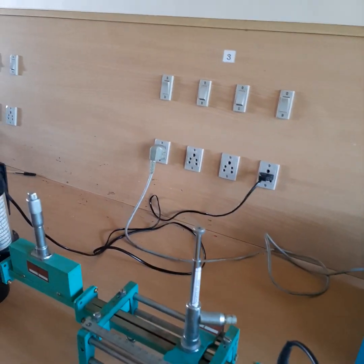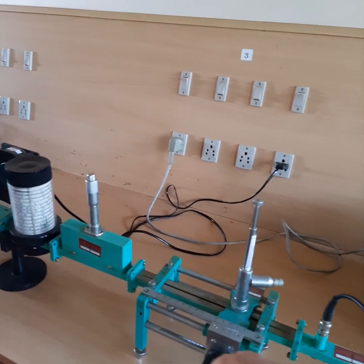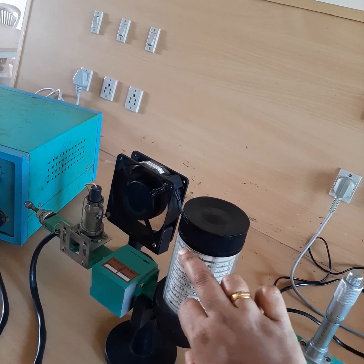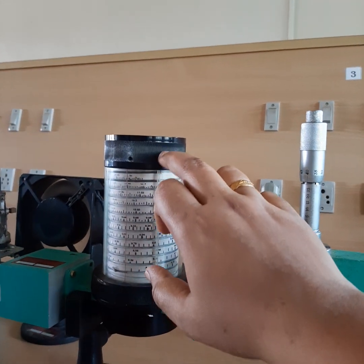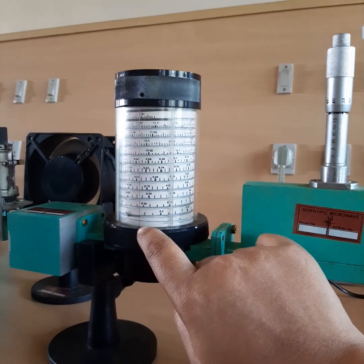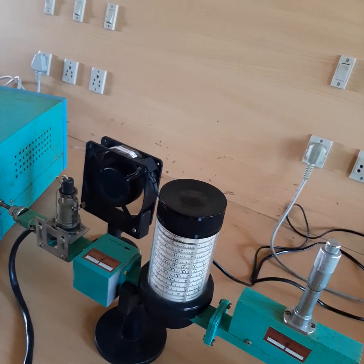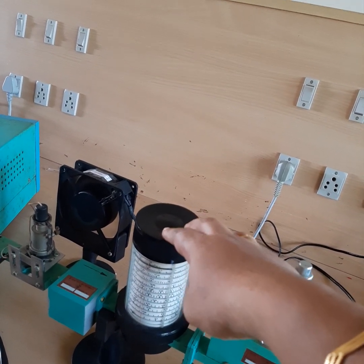We can ensure the bench gives maximum output through the waveguide and then find the frequency of the wave passing through it using the frequency meter. Before doing the experiment, you should ensure that the two lines of the frequency meter are either in the uppermost or lowermost position. Here we have set it to the uppermost position. Next we rotate the frequency meter to see a dip in the CRO, meaning a reduction in amplitude.